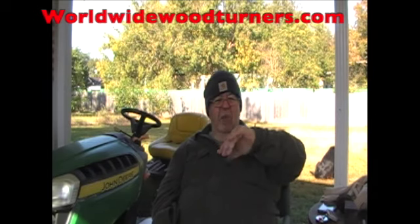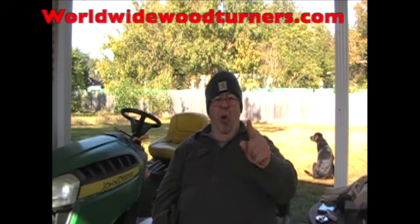That tip came from years and years of playing in the shop. I started my career over 50 years ago, almost 60 years ago. In the shop, that's how they adjusted the big drill press. We had a massive drill press. Somebody wanted to make sure it's level and plumb, and the guy running the shop, Wimpy, says that doesn't matter. From that point on, I realized it's not level or plumb, it's perpendicular. I hope that'll help you out.